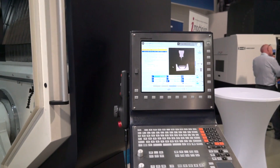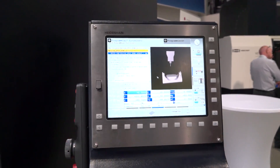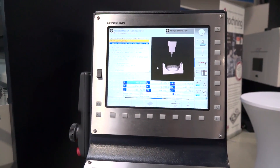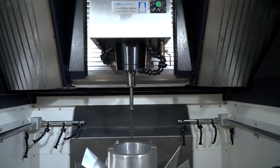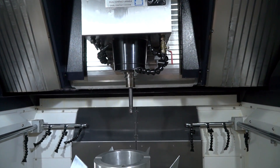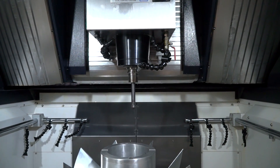It's a Big Plus spindle as well — a dual contact spindle so you've got face and taper contact, which helps with accuracy? Yes, high rotations require that we have an HSK tool taper or Big Plus. We need the additional contact for the strong cutting forces in some cases.